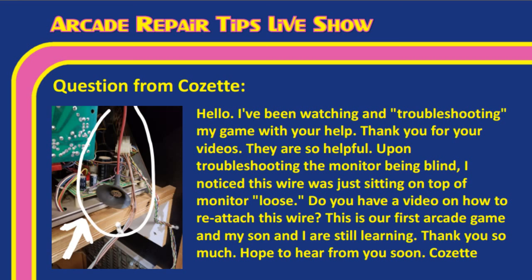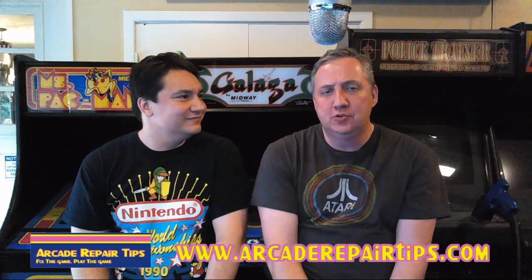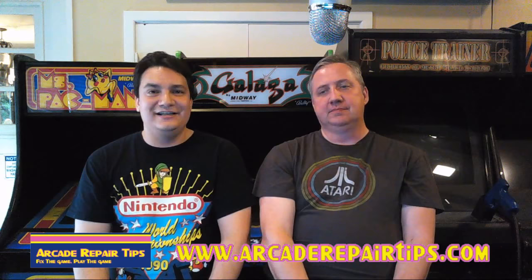We are joking. Yeah, do not touch that. Do not come in contact with that, especially with the game powered on, Tim, because what is that? That is the anode that goes and carries your high voltage up to your tube. That is correct. And so you do not want to even turn your game on with that thing disconnected. Exactly. We could have major electrical issues, right?